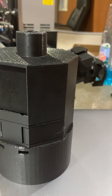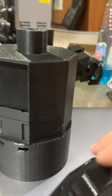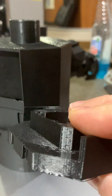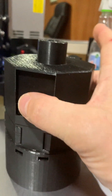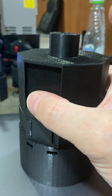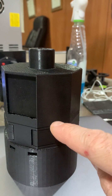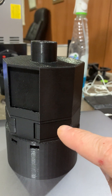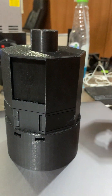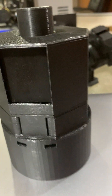The other problem was with this seat here at the bottom — it was too thick, so there was a gap and it was actually pinching everything. Printing one that's 1.2 millimeters thinner was the right thing. I basically did it with zero tolerances, took a photo, and inferred from the wall thickness that it was 1.2mm. I shaved 1.2mm off the bottom, put it in, and it works quite well.